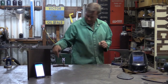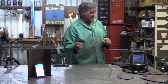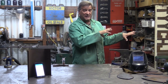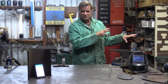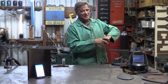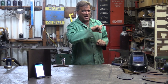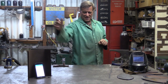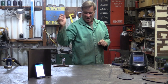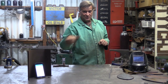Here it is. What I've got is a piece of nasty old half-inch plate I got out of the scrap bucket, clamped to my bench. The welder is set up at 29 volts and about 600 inches of wire feed, which is just about maxed out. At 30 volts the machine doesn't want to weld quite right — it needs 0.035 wire for that. So I've got 0.030 wire, 29 volts, maxed out on the wire feed. I've got a timer over here — let's just fire the timer, fire the gun, and run until it quits and see what we get. Grab a cold one, we'll have some fun.